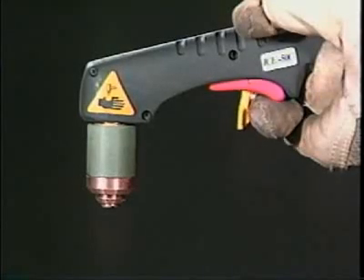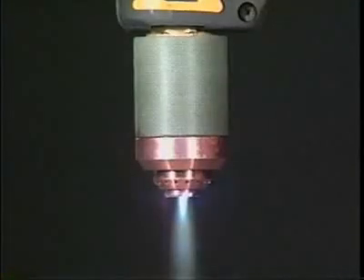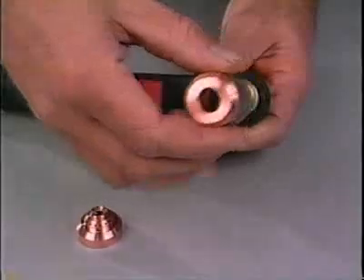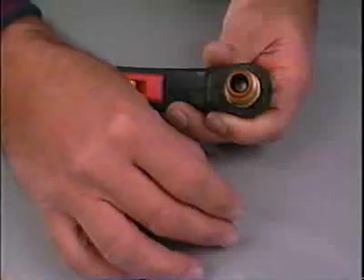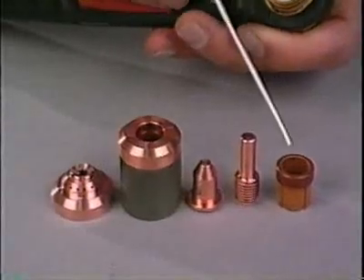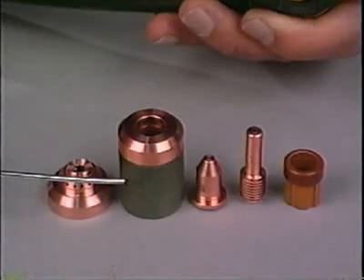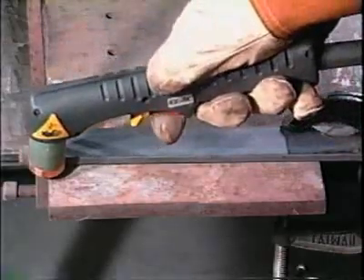The development of the plasma cutting torch is one key to the success of the process. Its components shape and constrict a high-pressure air stream to a very small diameter. This stream, when ionized, becomes the plasma that will conduct electricity at the current and voltage level required to cut metal. Removal of the torch shield cup reveals internal torch components: a tip and an electrode — the most common consumables. Other parts include the swirl ring, designed to shape the compressed air, and an epoxy cup to enclose the parts. A standoff or drag shield may also be included.